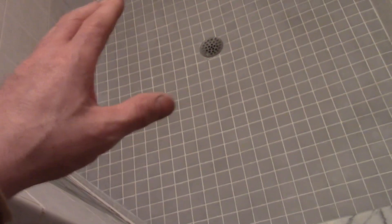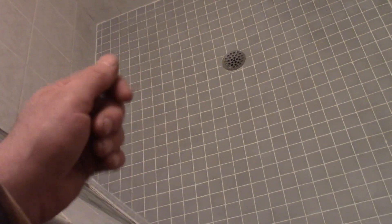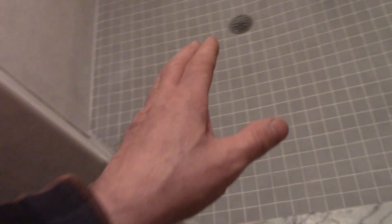John here. We've got a couple of projects going on. This bathroom was just regrouted — I scraped a lot of grout out, got most of it with a multi-tool. I did damage some tiles here and there. This section has the same tile, but grouting it didn't work out as well because this platform is cemented and was done right. This one is just over plywood. This piece is cement board I cut to fit, and this piece here is PVC.